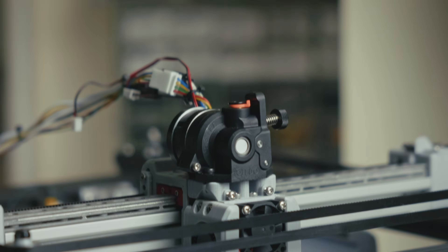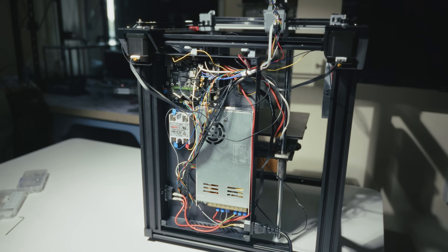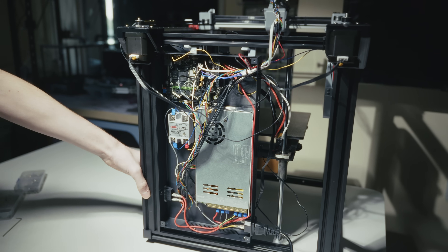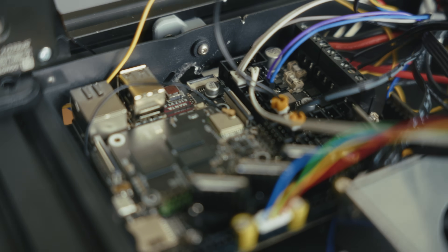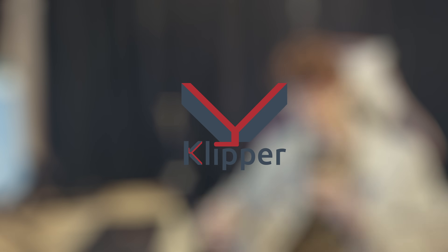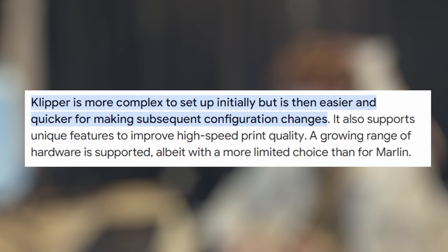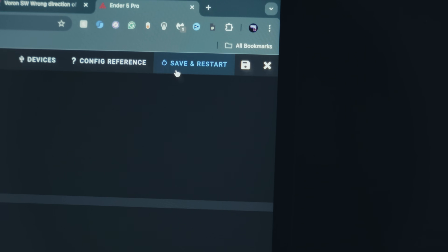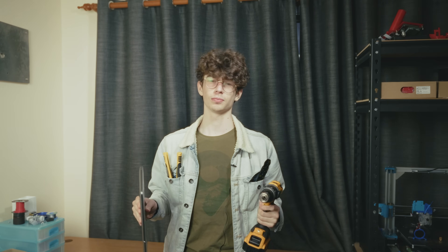That's really rewarding to see. I don't like doing wiring but I may as well do a good job once rather than a poor job twice. This is the first power on — hopefully there's no magic smoke. The CB1 is on, main board's on, we're getting a hum — that's great. The CB1 has joined the network. I had to dremel out some of the frame because the micro SD card wasn't fitting. It's Klipper time — this firmware is faster, easier to make changes to, and adds network connectivity. I'll be using Mainsail as the interface, and making a config change is as easy as that.